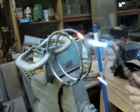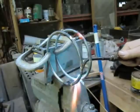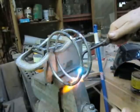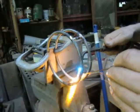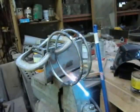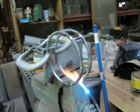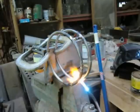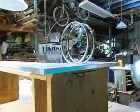Heat it up from the back side and suck some of that brass - heat it up all the way through, because the brass always goes towards the hottest point. So we'll just drop it in there, and come up underneath and just warm up everything until you see the brass pull back in through to the other side. And there it goes. Our frame is built, we're pretty well set up there - I think a little bit of tweaking on the bottom, but that can come later.